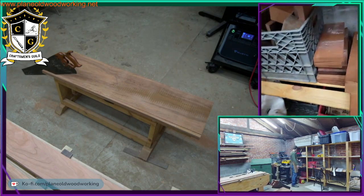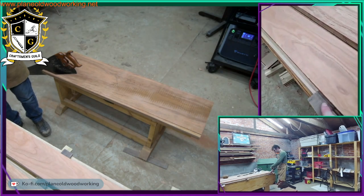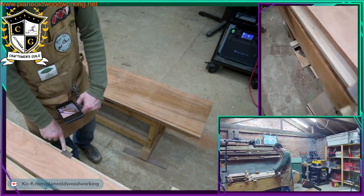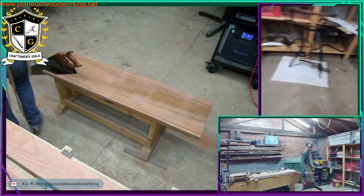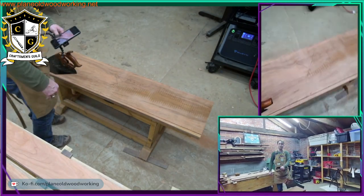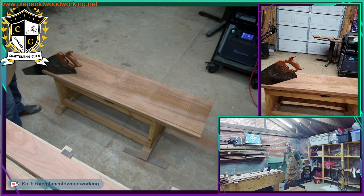Like, just chunks and chunks of scrap wood that I do keep. And then if you look at what's stickers between my boards, that's quarter-inch walnut, poplar, walnut, poplar, walnut. That's just a chunk of walnut. At the minimum, if I find nothing to do with this offcut, it'll become stickers. For stacking wood, I'll just cut it into small, like three lengths, and it'll be good.